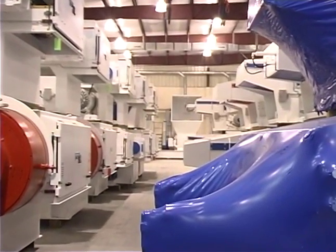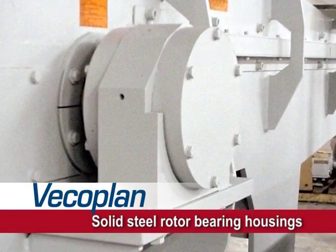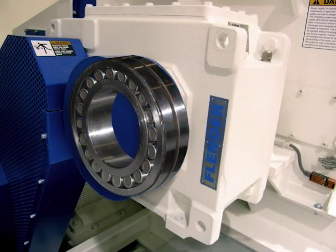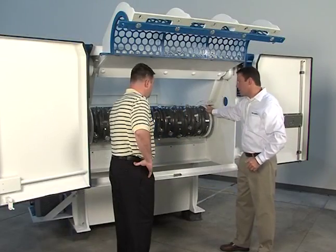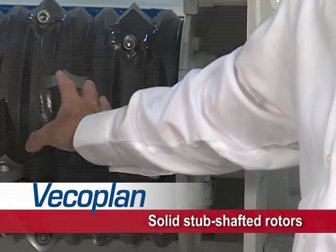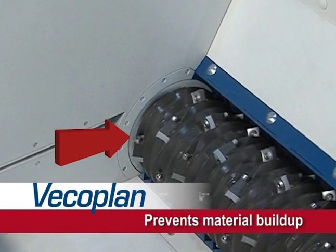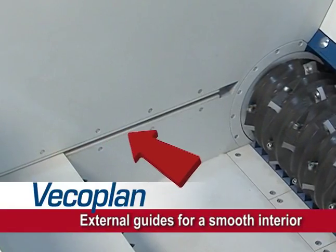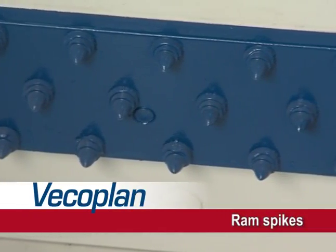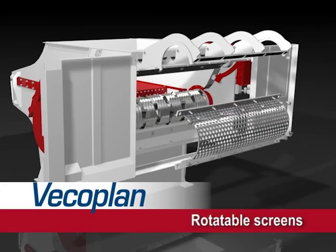Total in-house engineering and manufacturing give us complete control over raw material sourcing and quality. For instance, VecoPlan uses only solid steel milled rotor bearing housings instead of cast iron. The bearings are double-spherical tapered roller bearings, not ball bearings. Other vertical machine design features include solid stub-shafted rotors — the stub-shaft design makes them easy to replace — rotating recessed end discs recessed into the inner sidewall to prevent material buildup, sidewall wear, and eliminate a potential fire hazard, external guides for a smooth interior that helps prevent material bridging, ram spikes to keep material from rolling, solid gearbox cases for greater strength and precision, and rotatable screens for longer screen life.